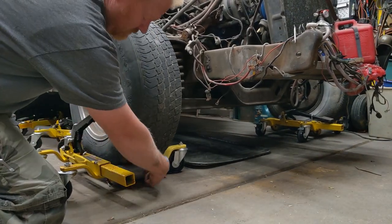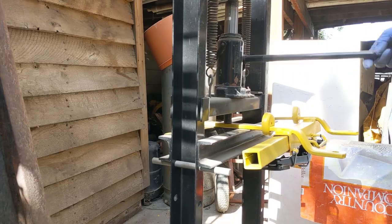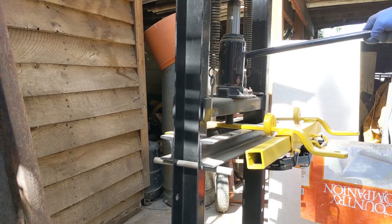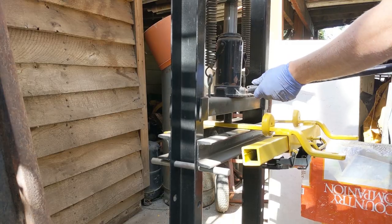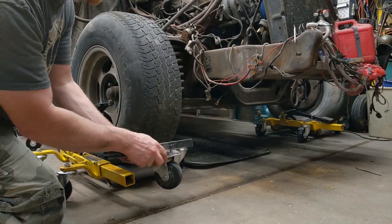All I did was weld in some structural support right there. I actually put this in the shop press, and added a little bit of what we'll call positive camber, so then the weight would level it out. But I welded a bunch of gussets in there. Amazing. The problem is, I'll show you with the caster.